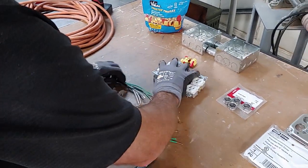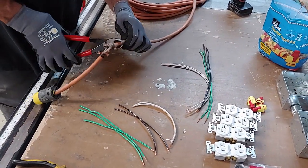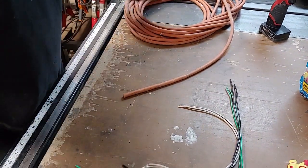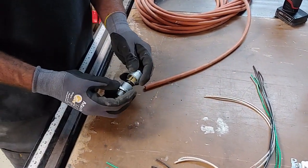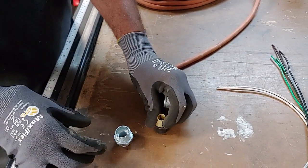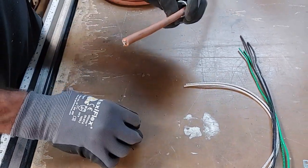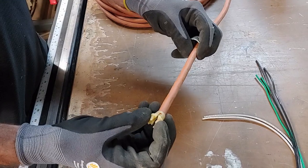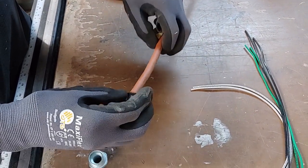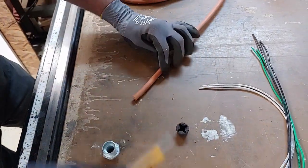The first thing we're going to do is cut our extension cord, cut off this damaged part, and insert it into our connector. We'll unscrew it and pull all the parts apart — just kind of keep them in order so you know the way they go on. Slide the back part on, then this piece next. Then we're going to go ahead and strip the wires back here.